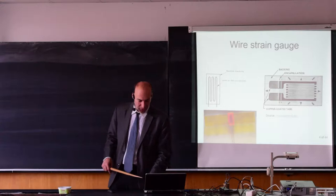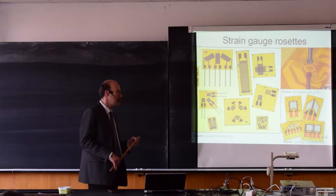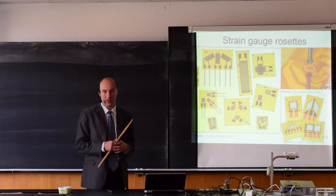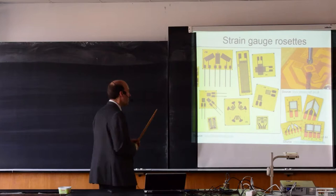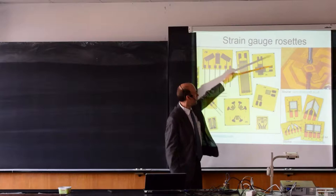This is a single strain gauge — a typical device. But for many applications, you need to measure strain in multiple directions. A single strain gauge is good if you want to measure strain in an individual direction, if you already know what that direction is. If you don't know that, you may use multiple strain gauges installed on the same backing material. This is called a strain gauge rosette. For example, this rosette has two strain gauges installed — one measuring in one direction, the other in a perpendicular direction.